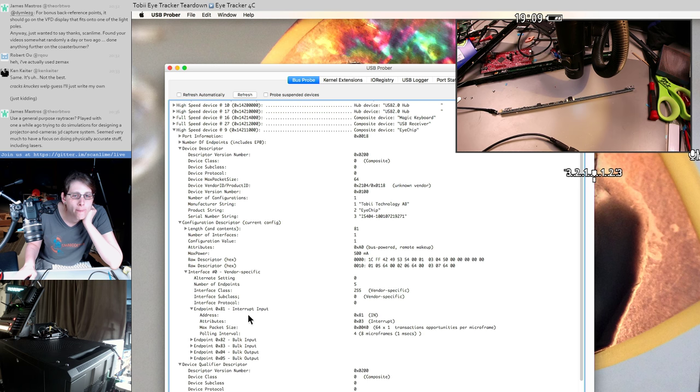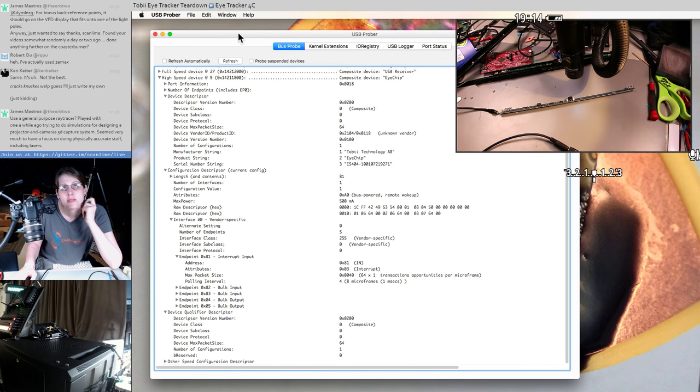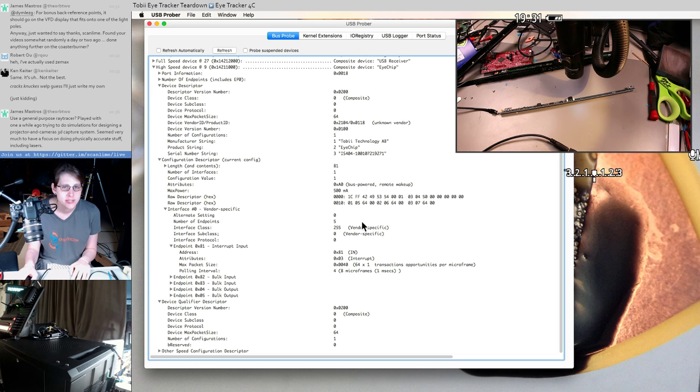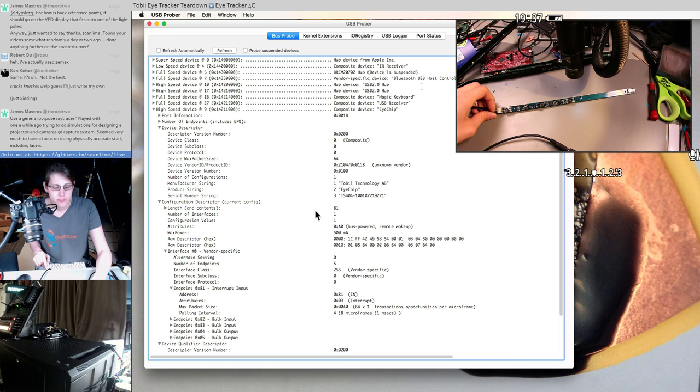Interesting. So I suspect this will be pretty interesting on the USB analyzer. Without any firmware loading, because we don't have any other drivers or anything, it presumably is already booting up into some kind of fairly active looking mode. This doesn't strike me as something that looks like a bootloader. It looks like it's doing its usual thing, so it might be loading a complete-ish firmware image off of that flash chip.